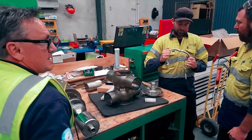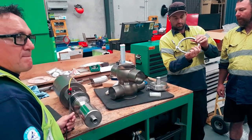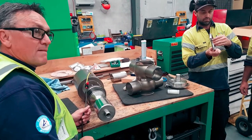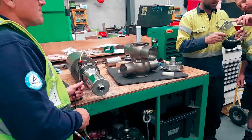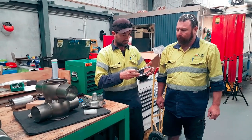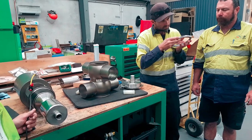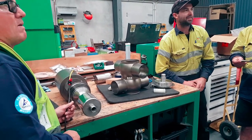Pass that around and tell me what you're sealing. All of those ones on our site can fail, so we need double clamps because of that. They've been over tightened. So we've gone to double clamps because we lost, you remember, 150 cubic metres of raw milk with one of those popping off.